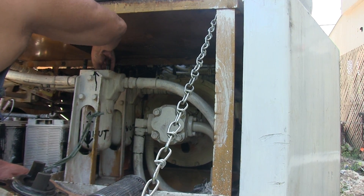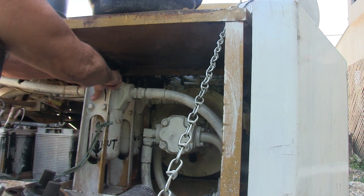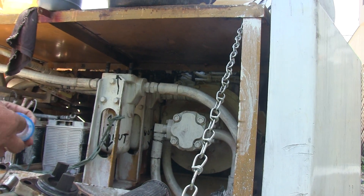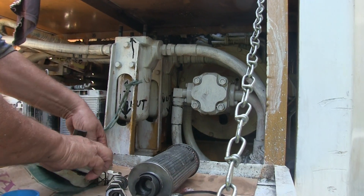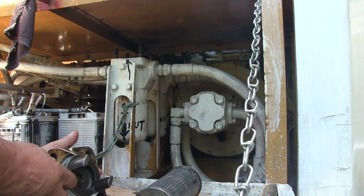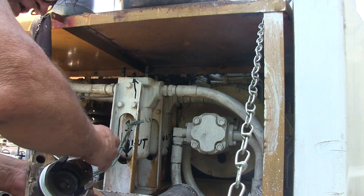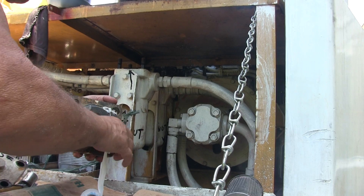When it gets down to the o-ring covered with Teflon tape, there's some small resistance — just push it down with your finger on both sides, and that's it. The second thing is I'm going to put a fresh layer of Teflon tape around this cartridge basket cap. It doesn't have to be a lot since there was already some on there — three layers, just wrap it on there like that.